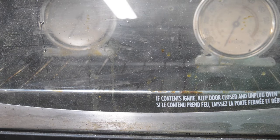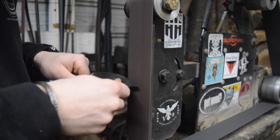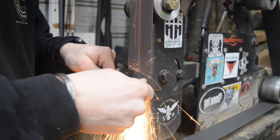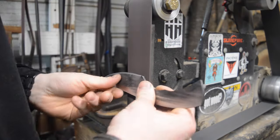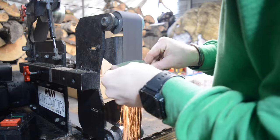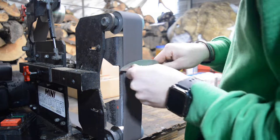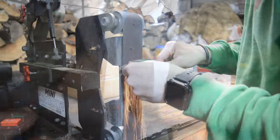Then it's out of the temper into my favorite part — grindy. We're going to start by grinding in the bevels so we'll have a really sharp cutting edge. After we get this knife ground up, we'll go start hand sanding, starting at 120 grit and going all the way up to 600 grit, which will give us a nice polish.